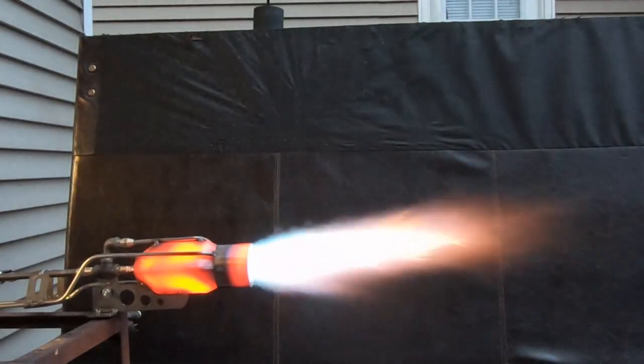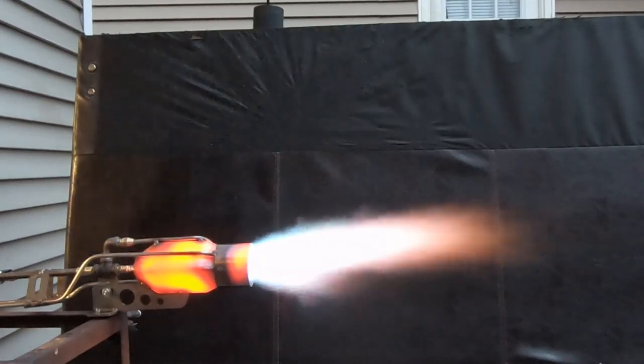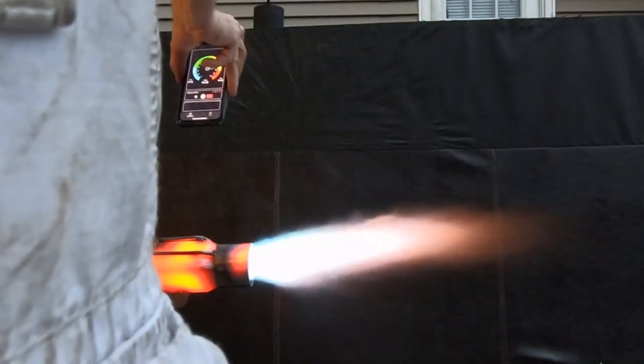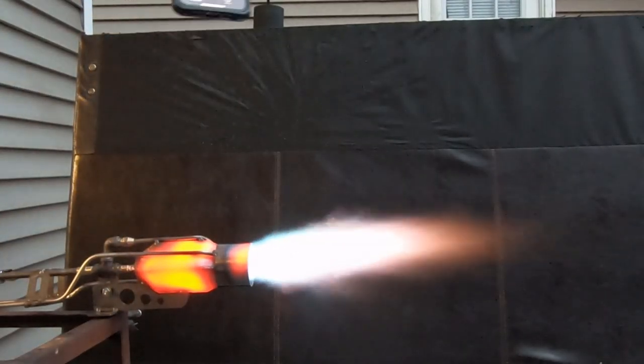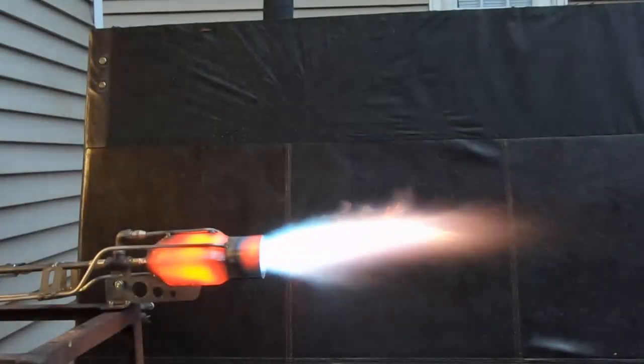You're going to notice the flame is going to get drastically smaller when we add oxygen — we did not change the fuel input, we're simply burning the same amount of fuel in a smaller area. The secret sauce to what I'm trying to make happen is this: consider you've got a foundry furnace going and you've reached the maximum temperature and you're trying to get hotter. If you turn the fuel up, a flame will shoot out of the top of the furnace. I never allow my flame to be six inches off the discharge port of the foundry because doing so actually decreases the temperature — there is a fuel-air mixture ratio that you need to achieve to get the maximum temperature, you can't just keep dumping fuel in there.